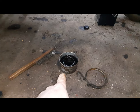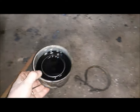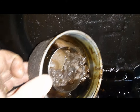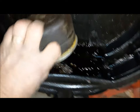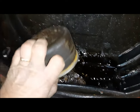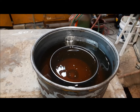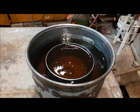While we're waiting on that stuff to cool down, we're going to service up the air cleaner cup. It doesn't look too bad but it definitely needs servicing. We'll dump this stuff out and see how much crud is in the bottom of it. Well, I'd say that's a lot of crud — sand, silt, yuck. That hasn't been serviced in a long time. Now we can put that back together.